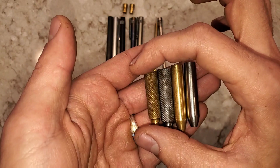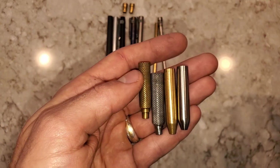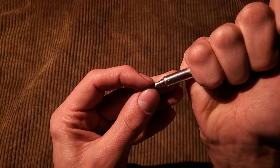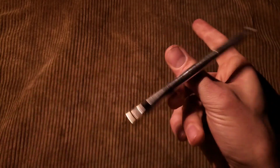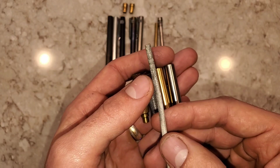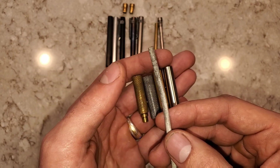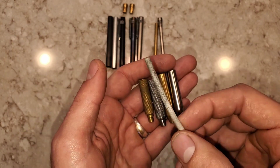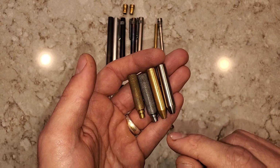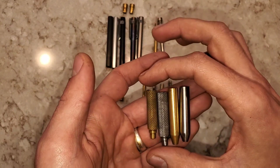I started out in brass. It turns out that when brass touches the eraser, it turns it all dark. I thought that was just oil and dirt from the machining process getting on the eraser, but it turns out the brass itself actually turns it this dark. So does silver, and so does aluminum, unless it's anodized. So I need something that's either stainless steel or titanium, two of the metals that don't do that. And that's what I went to next.